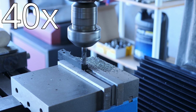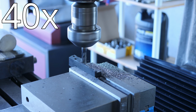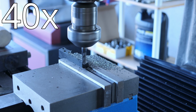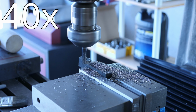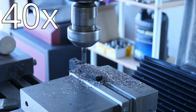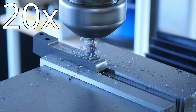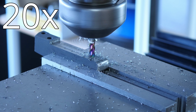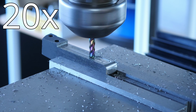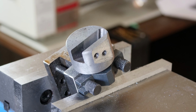As you can see, I was removing a fair amount of material from the shank of that holder. As it was, if I put the insert in the center, there wouldn't have been much meat left for clamping with grub screws, so I just shaved off less than I originally planned on. I added a shallow pocket to the shank so that if the grub screws back out a little, they'll still catch in the pocket and the tool won't embed itself in my cranium. I also went back and cleaned up that slot off camera because it was mocking me.